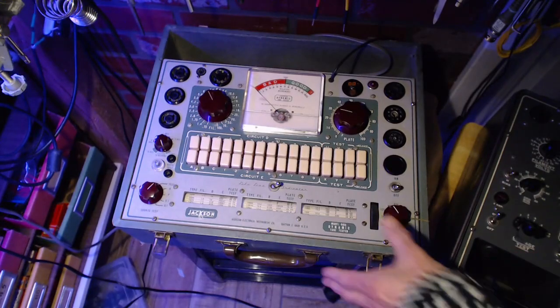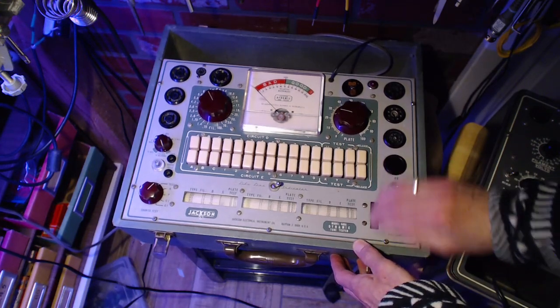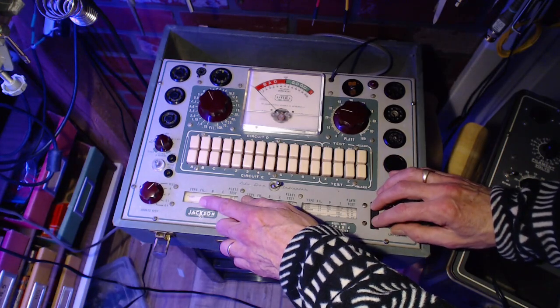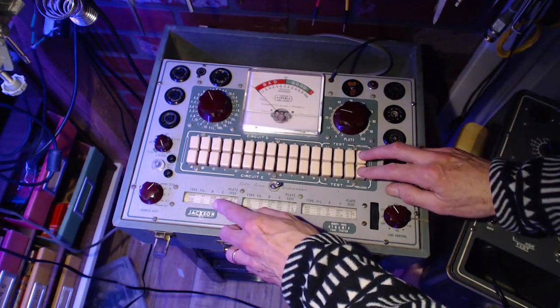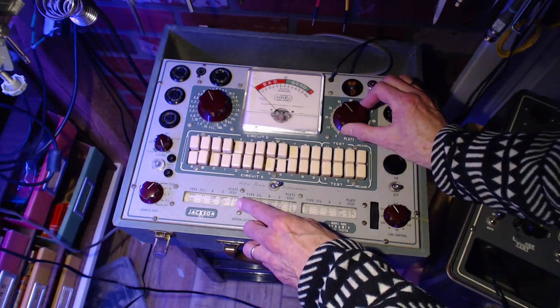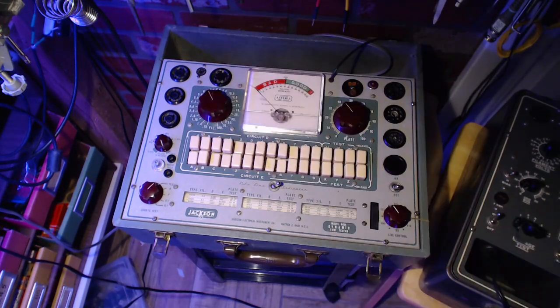Well, you know what? I happen to have another tube tester right here. Let's stick it in this one and see what happens. So this would be a 6AQ5. Okay, so 6.3, 237, AC156, 38 on the big wheel. W for the test. Okay, so we're going to come right out of this tester, 6.3, and right into this one. Keep the tube hot.